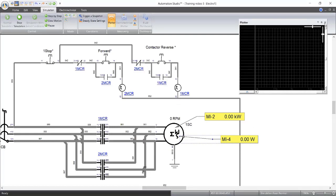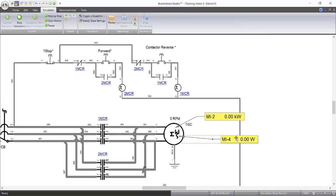I wanted us to see the way it's moving. You can see the startup current is high. That's what we call startup current. That's why they said it will use times 3 of this normal current when starting up because of the initial torque. This thing was at rest before. You understand? It was at rest. So immediately you start, it will consume more power to start.